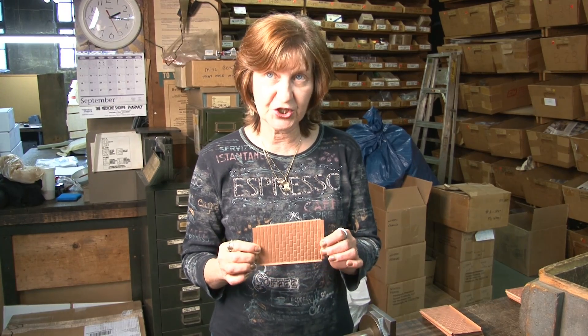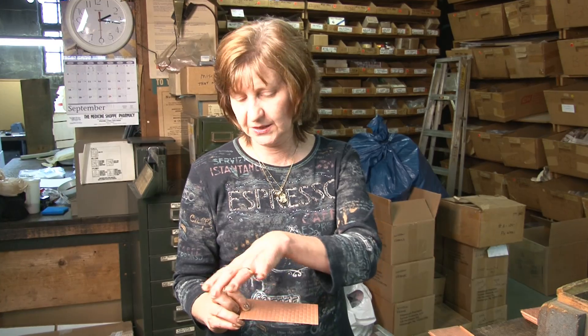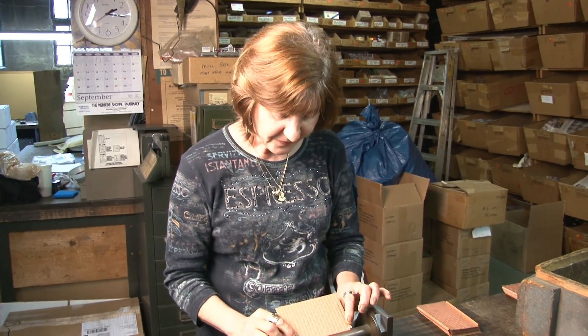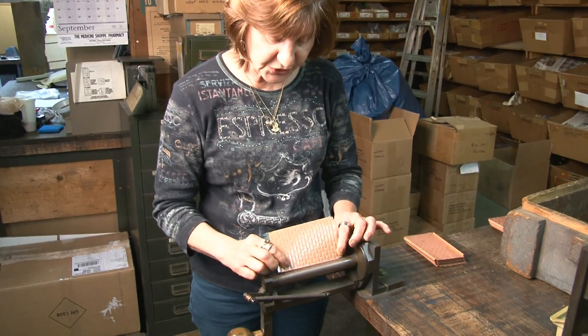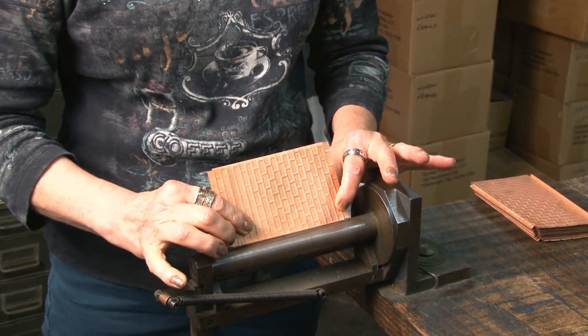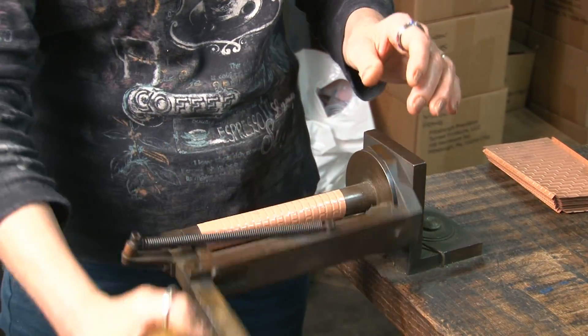What I'm doing here is the chimney. There are four steps to making it. These are cut out and then punched out at the punch press, then ran through a bricker, and then they come over here to me. There's a slot here that I'm putting this into. I'm rolling the chimney. That's the first part.